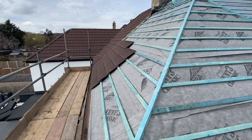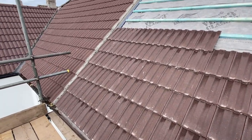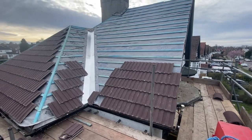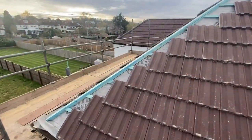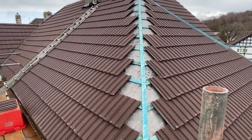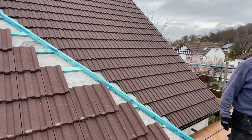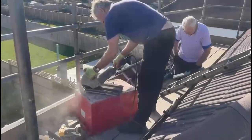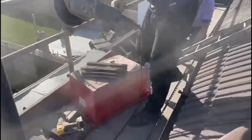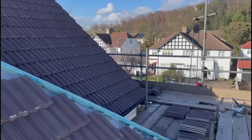The state of the plasterboards in the ceilings we'd already laid — directly underneath the loft in each of the rooms — only two got damaged throughout this process. A foot went through one of them and the other just fell off. So bear in mind the order you do things in: it might be worth waiting to do ceiling plasterboards until after you've done the roof. Mark also spent a lot of time cleaning up the loft — a lot of foam flew down the street — hoovering and sweeping, with bags and bags of foam going to the skip. We had two skips throughout this whole process.